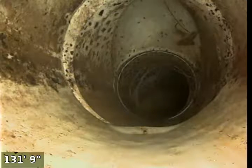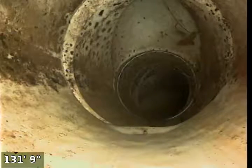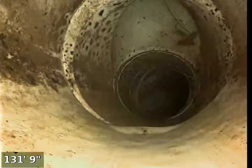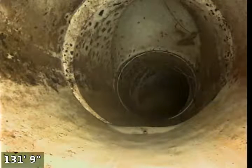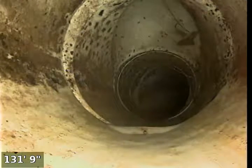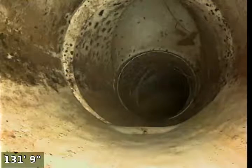We did mark it with a green flag. The pipe is 25 inches deep, so it's just barely over 2 feet deep, and we've written 25 inches on that flag and inserted it into the ground where this T-junction is. Now the T-junction, because it is a hillside, may be laying at a steep angle, and the clean out might have another angle to bring it up, so it may not be coming up vertically right above this T. It might be coming out at a slightly different spot, but there is an access if somebody was to dig in that general vicinity of our flag to expose this line and that clean out.